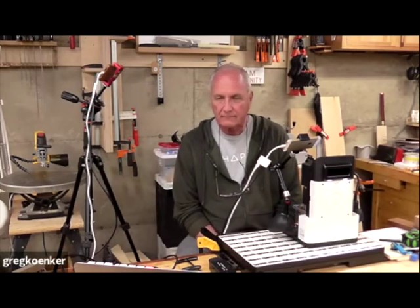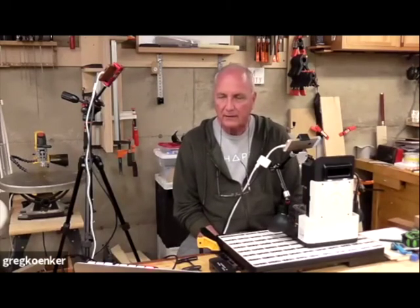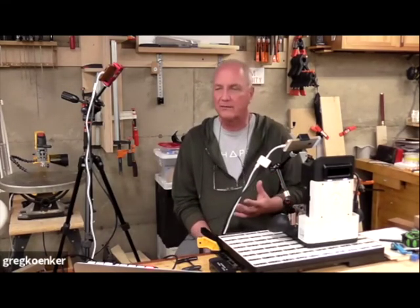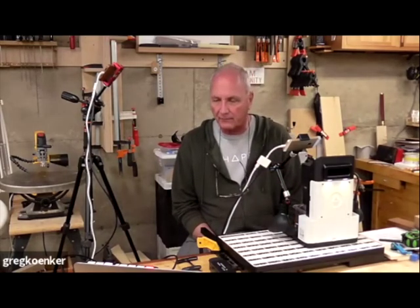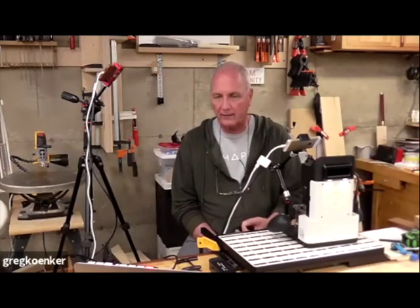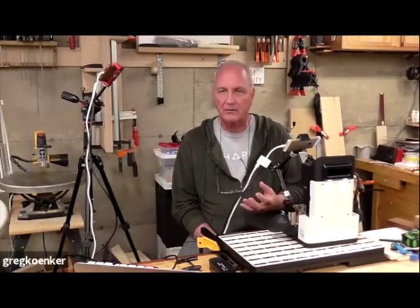That was good, Greg. I have a quick question for you, because I've just stuck to the bits that Shaper sells. I was wondering if you've experimented with different bits, like a bowl bit or anything like that. I haven't done that, because this is a disadvantage of the Origin, and frankly, my CNC machine uses a trim router motor too. So you're limited to a 1/4 inch shank bit, 1/4 inch or 1/8 inch or 8 millimeter. But like a bowl bit or something, I guess you can get them.